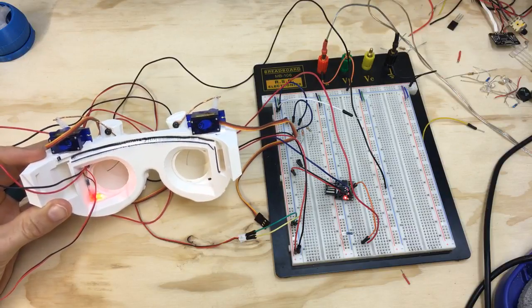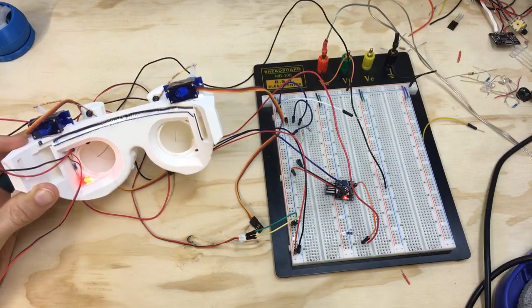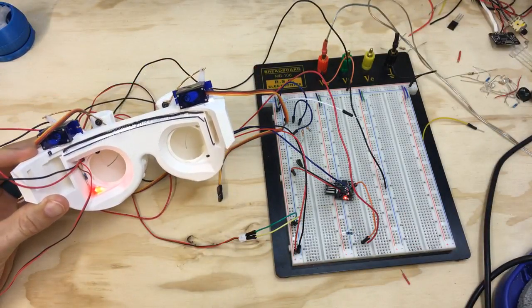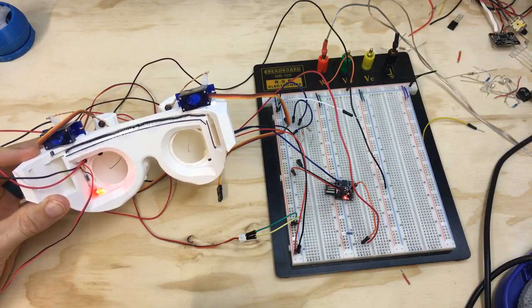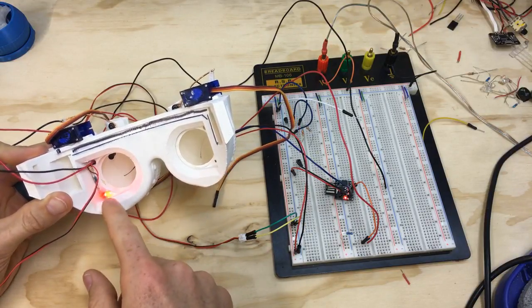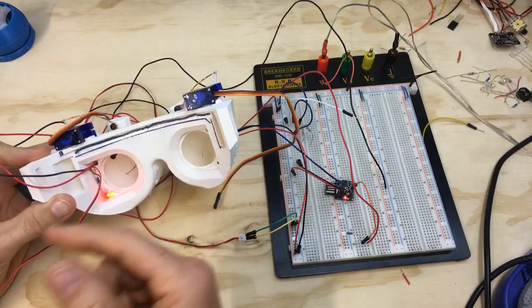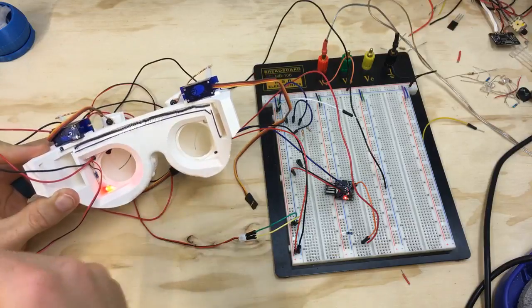I'm sorry if I say your name wrong, but is it Pratik Mokashi? He says, put the infrared LED in receiver pointing in your eye. Normal LED won't trigger it. Okay, well, we'll give it a shot. I think because using this triggers it whenever it's all plugged in, that does show that visible light will trigger it. But this might be more sensitive to infrared light. And so, like I said, I really like the looks of having the red LED. I'm gonna try to make that work. If that does not work, then we're gonna switch over to these infrared LEDs, and it'll be hopefully working no problem.